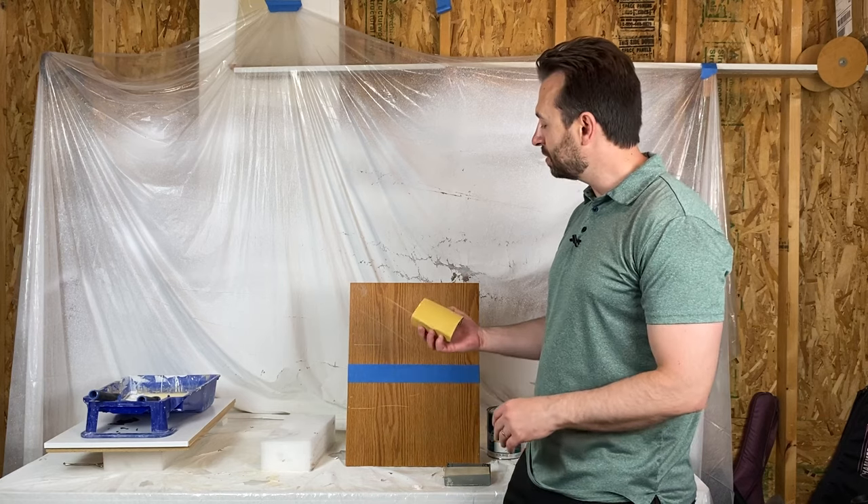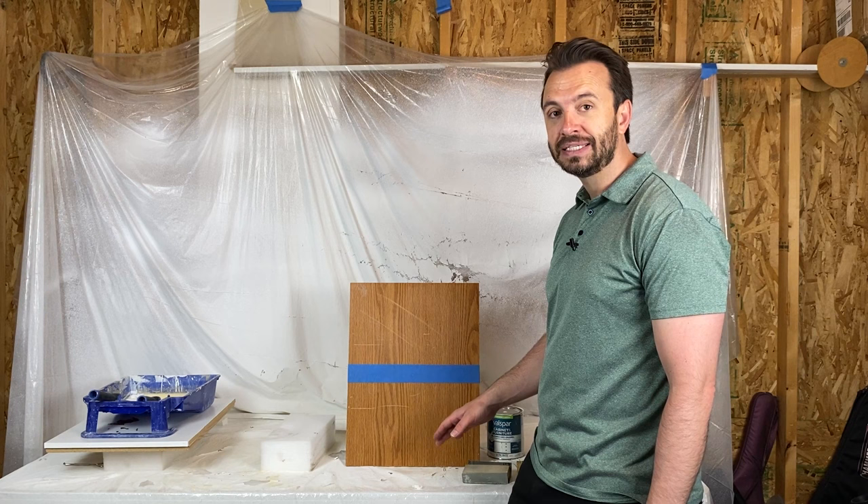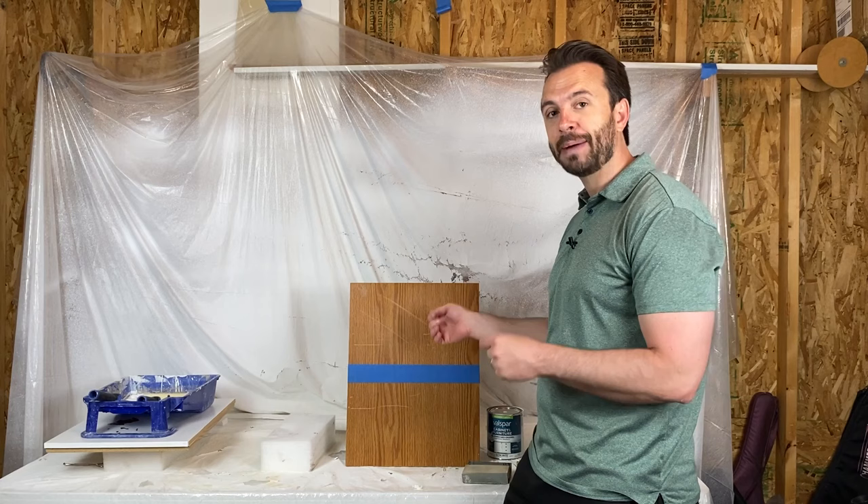For this project, I am going to be using 120 grit sandpaper on the top of this laminate, then on the bottom I'm going to be using 220 grit sandpaper. After that, I will paint it, then follow up with some tests to see if actually sanding your laminate before you paint it actually helps it hold up and produces different results at the end.